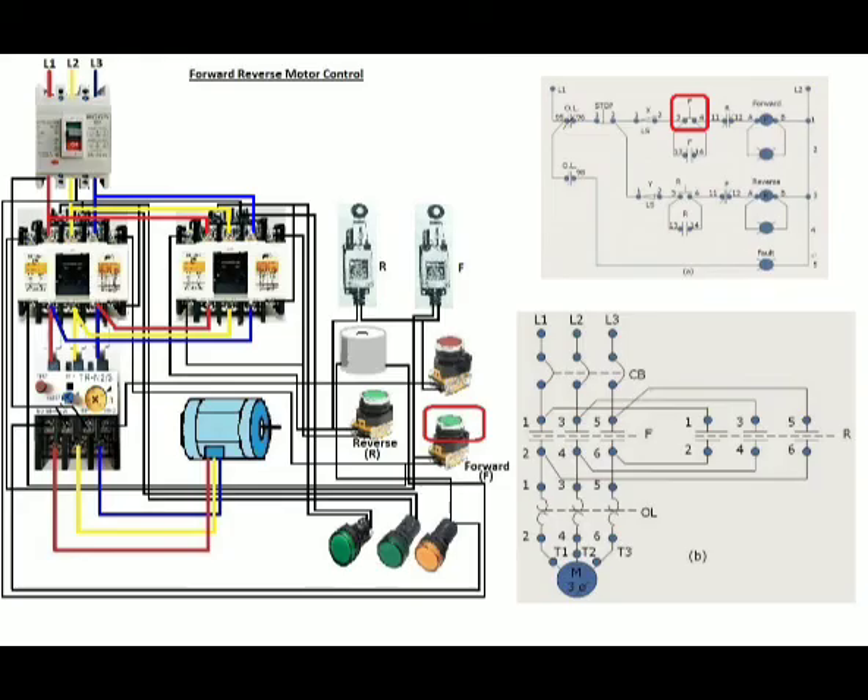To discuss how the forward-reverse motor control works, let us start by pressing the forward push button. This will energize the magnetic coil, causing the simultaneous closing of the normally open auxiliary contact while opening its normally closed contact in series with the magnetic coil of the reverse magnetic contactor, to prevent it from energizing during the forward running condition. Furthermore, upon energizing the magnetic coil, the main contacts of the forward magnetic contactor will also close, thus running the electric motor in forward rotation. During the forward or reverse running condition, changing the rotation can only be done by pressing the stop push button, thus cutting the flow of current through the magnetic coil. This may also be done by the movement of the lever of the limit switch, in such a way that the internal electrical contact will open the current path.